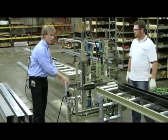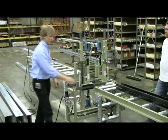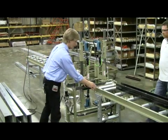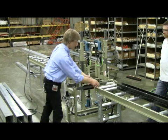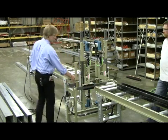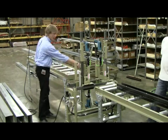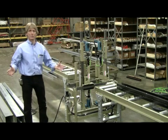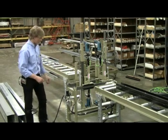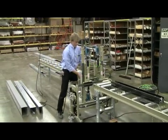Ideally, you're going to take this machine, anchor it to the floor, shoot it in with the transit, secure it with anchor bolts, and do the same thing with the conveyor. Leave yourself about 12 inches or so, that's your personal preference, so you can move the material through. Leave yourself about 18 inches to 2 feet, depending on how short your headers are, so an operator can walk through here quickly. Because if you have to walk all the way around, it's a pain. That's too far to walk for one guy generally, especially if you have to do it multiple times during the day.